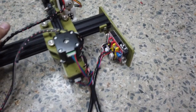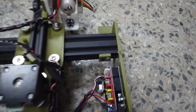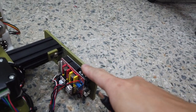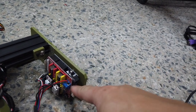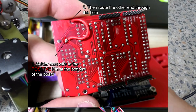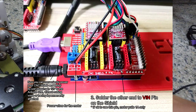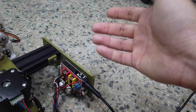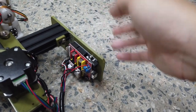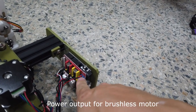Now let's talk about electronics. There's an Arduino Uno here with a CNC shield V3. To make it easy to plug in the power supply for the whole board, I bypass — I jump — a red wire from the bottom of the power input. At the bottom pin, I solder the wire and go to the VIN pin of the Arduino Uno. So you just plug it in and it will power on, instead of cutting the power supply wire and putting it in here.